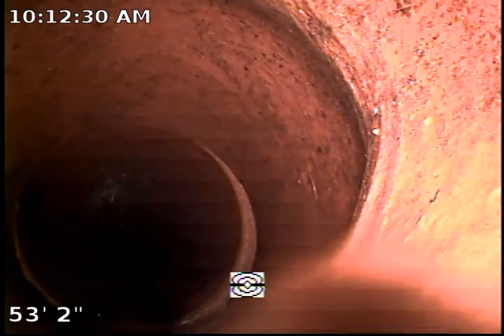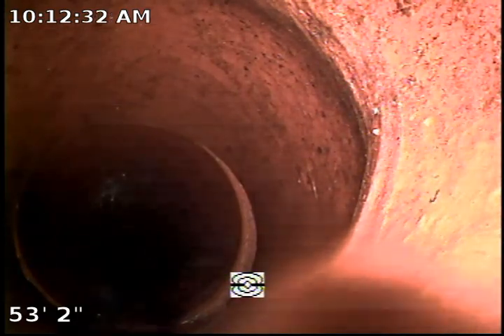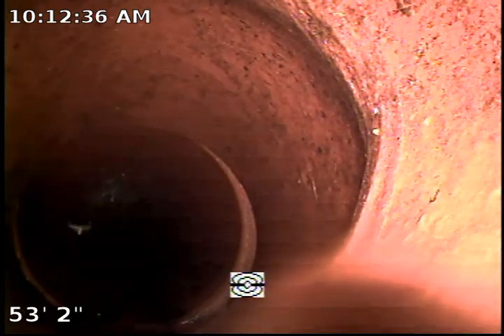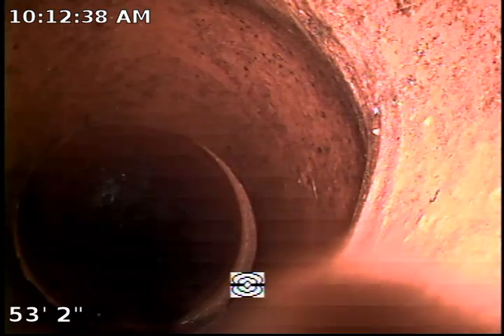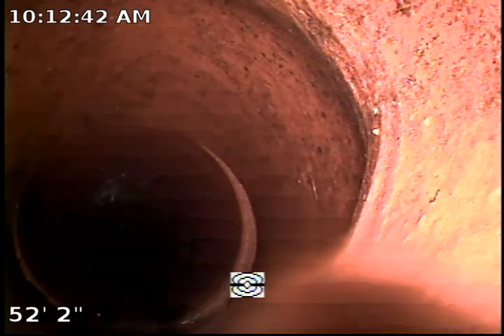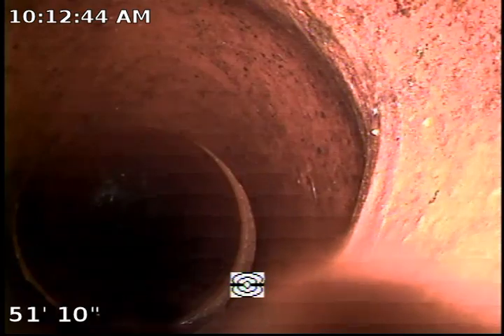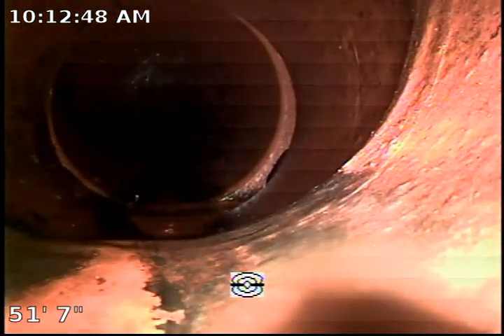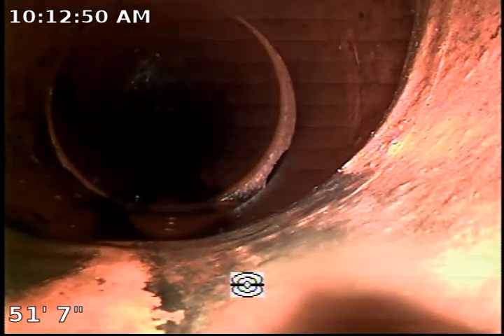This section is approximately at the property line and about six feet depth into the ground. After this point, it's going to be the six-inch pipe connection most likely. As you can see, we do have a little bit of an offset in the line. I'm going to go ahead and shoot a photo of that area — this is a better image right here of the offset.